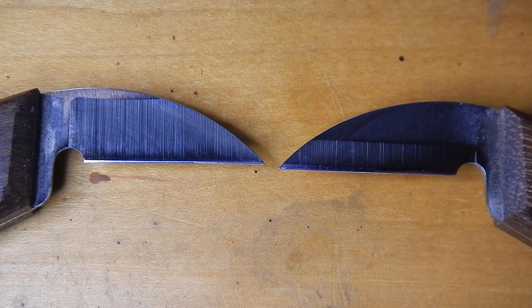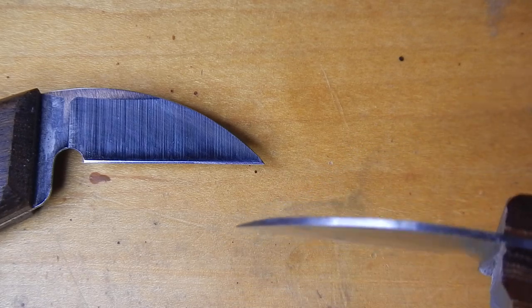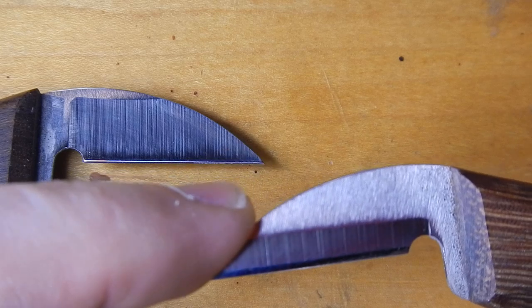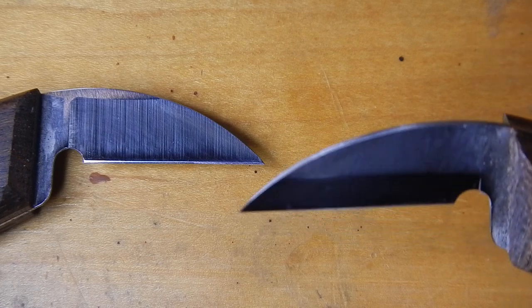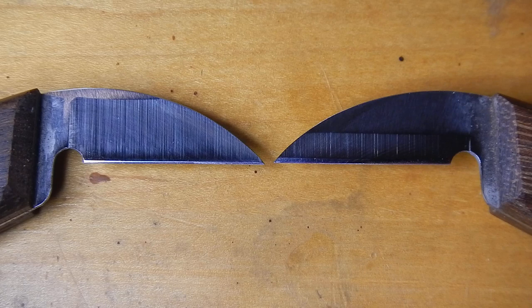For cutting angle, you can think of the back of the blade here, the spine. The keenness is nice and smooth, so it's a keen surface, but obviously very dull — a very flat, 180-degree angle basically. So both of those factors have to be in play in order to make a knife cut through wood very well, which is obviously the goal for chip carving.